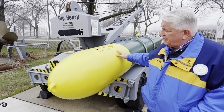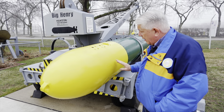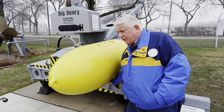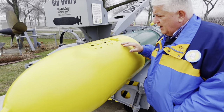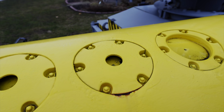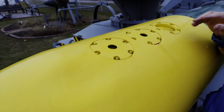It has the same shape, dimensions, weight, and everything as a warhead, except that in place of the explosives there's water ballast, which has roughly the same weight as the explosives. Under here there isn't the exploder tray, but there are these recovery aids. By the way, you're going to notice dents — that's not from our poor handling, that is a result of the Navy's mishandling. These recovery aids help you locate the torpedo thousands of yards downrange after it's passed underneath your ship.